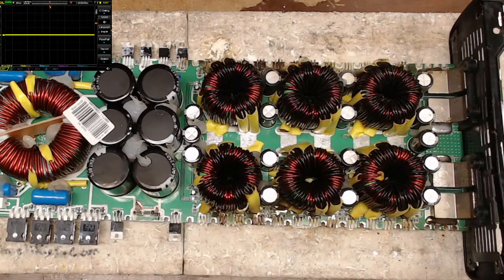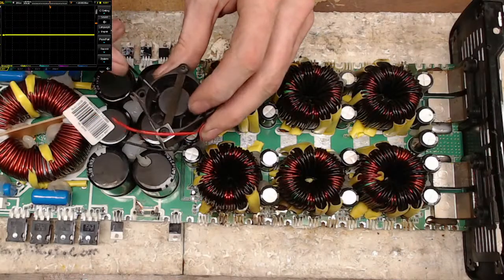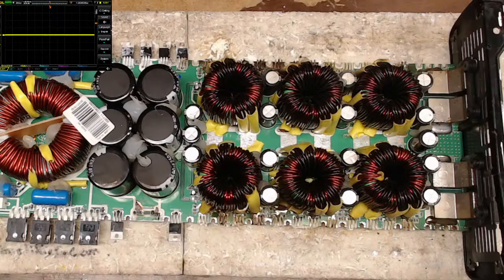I have to make my plan of attack for the rest of the day, which I think what I'll do is clean up that SoundStream Tarantula, that 10K. I'll clean up that board, get some power supply transistors put in, and probably just record a video on the power up of that for the owner. And then on this 15K here, I will go through and pull all the transistor legs and repair the traces, probably service the fans, and, oh no, replace the fans. The fans have got broken blades in them, so I will replace those. We'll get this board back up and running.